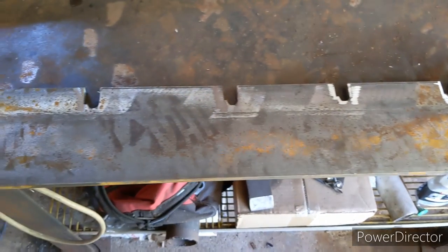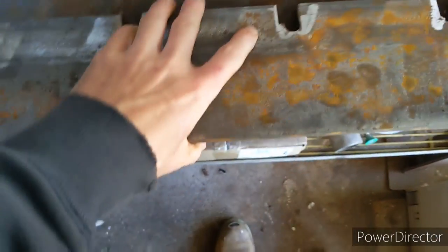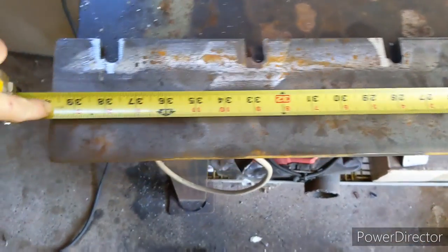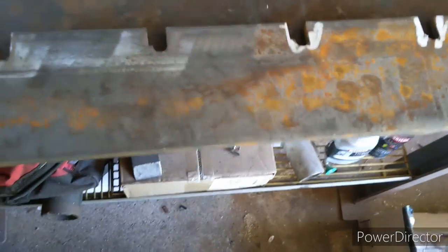So you've got your plate and your forks. The last thing you need is a plate to hold the forks onto the back plate. If you look on these forks, they have a little adjuster up here that pulls up a rod or bolt — that thing is roughly half an inch wide. I got a plate that's three-eighths thick, measured to almost the full length of the plate — 40 inches — and drilled half inch holes five inches on center. It's really up to you how far you want to space the holes, depending on how much range you want the forks to have.